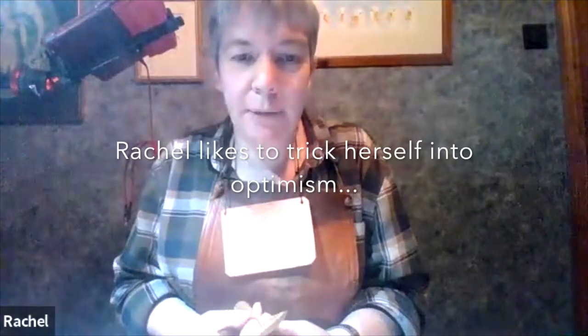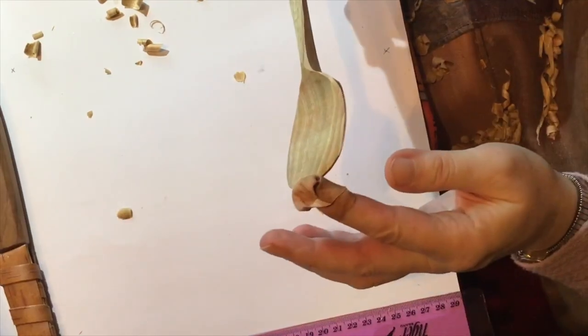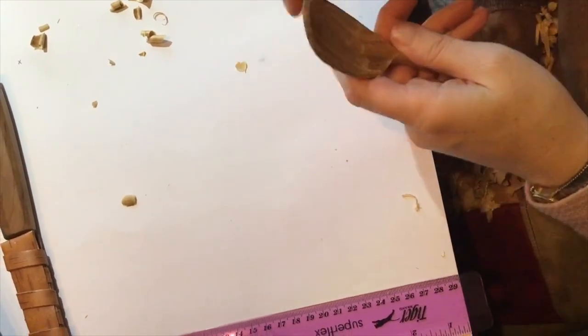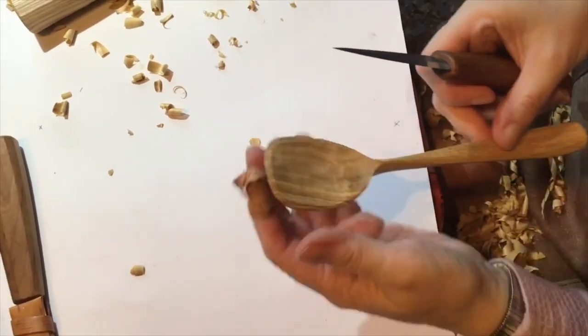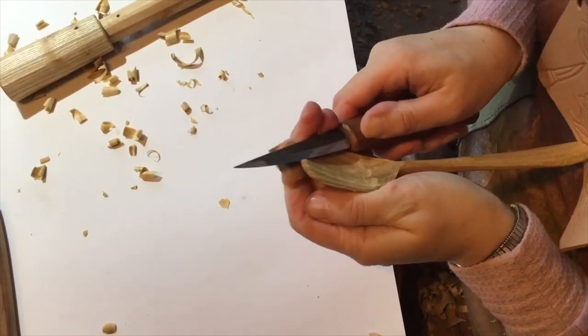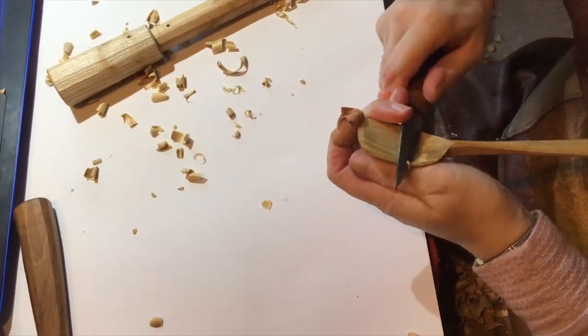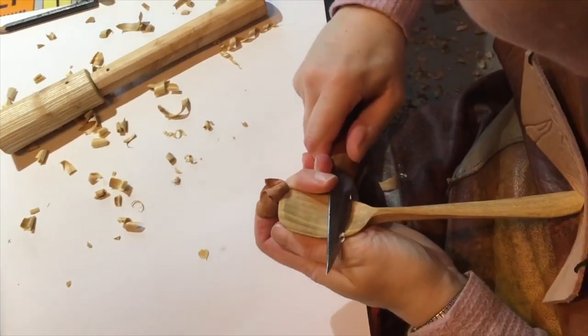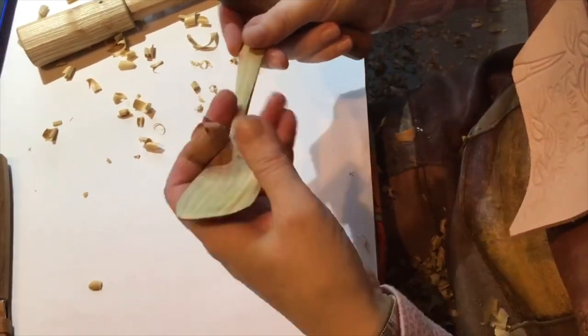So I've taken out, this is the first time I can actually see both sides of the bowl at the same time on the crank. So this last pass around the top surface of the crank is to make sure that it's symmetrical side to side, as well as just cleaning up that surface. First, that surface is pretty angled down this way because of the way the knife had to be. Now I'm flattening it off so it would be a parallel surface with the bottom of the spoon, the handle, if the handle was flat. So the knife is very much parallel with the top of the spoon.